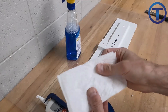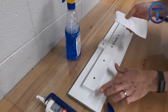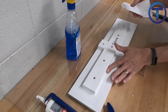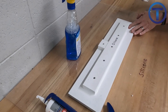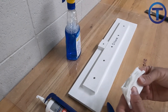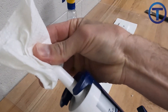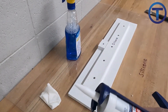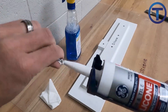That way the paper towel can be used for as long as possible — once it's full, throw it away and get another one. Take time to go over this carefully, smoothing it out in small sections at a time, not applying too much pressure, going over and over until you're satisfied it has a nice smooth, clean surface — no bumps, no smears, no lines or seams. Watch out: the caulk may still be oozing out while you work, so keep that clean, even after you've relieved the pressure. You have to be constantly conscious of the end of the tube.